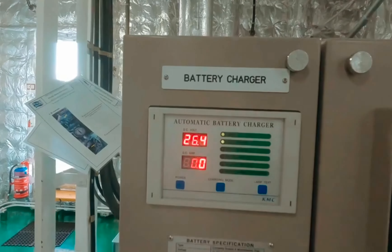Right now the generator is in auto mode. Before taking on load, you have to check all visual inspections — if there are any leaks or any abnormality. Check the oil level of the sump of the generator, and then check the radiator water levels. In case of blackout, the emergency generator should be capable of taking on load within 45 seconds. This is the oil level dipstick where we can check the oil level is above normal level. The radiator water level can be checked by opening this knob.